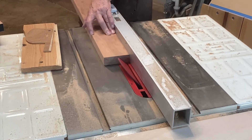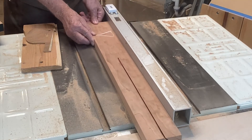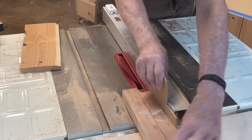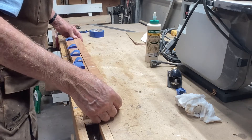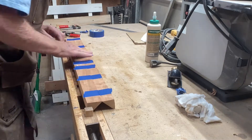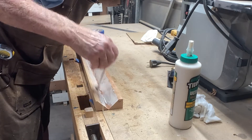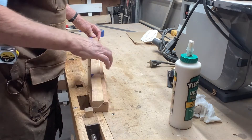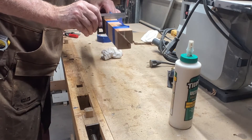Since I don't have large enough stock for the legs, I like to cut 45-degree bevels to get face grain on two exposed sides. I take the two pieces and put them back together with blue painter's tape. After applying glue to both sides, the tape causes them to snap together like a spring clamp. I check for square and I'm happy.